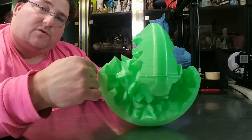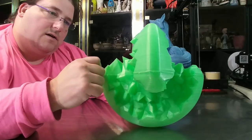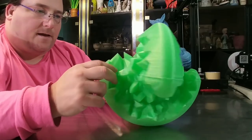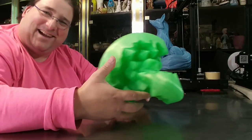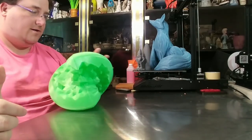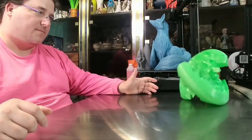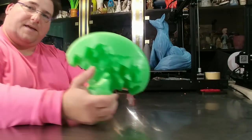I used a brim so the pieces are nice and flat, although I noticed the scaling is off a little bit — so check that. Rotate them 45 degrees and make sure their X and Y dimensions are the same for both halves, besides just scaling them up. But otherwise it went together fine. I got rid of the box in the middle and just glued them together. And what's also interesting is it spins like a top. But this will also do your little roll across the table. I just think that is really neat to watch.